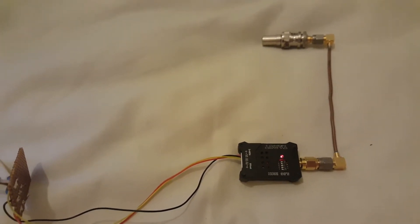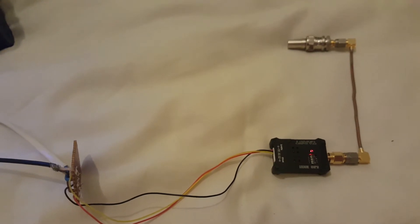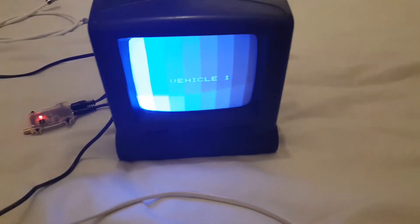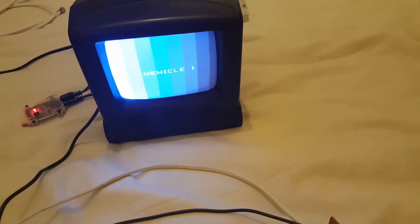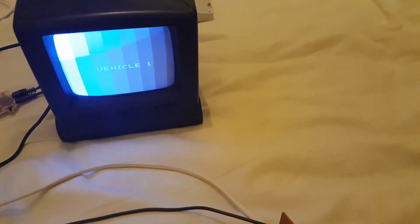It's a cheap and easy way to have a dabble in ATV. A lot of people muck around with Gunn diodes and LNBs, but Gunn diodes are getting very hard to get hold of and they're unstable, whereas these units are PLL locked. I'll put links in the description and answer any questions as best I can. If you've got a friend a mile or two away who fancies trying different things, give this a go — it's definitely a bit of fun. 73s for now.